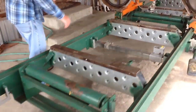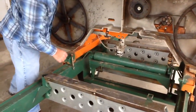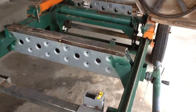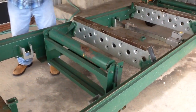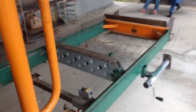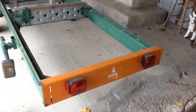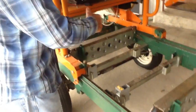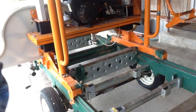I've done some changing on these guides — I took away the steel and put in aluminum over here and right here. When you hook up the winch, it drops in that slot right there, or here — any of the ends. It's a pipe pole with an electric winch on it, and I just use it to roll the log. I got it hooked up with lights so you can tow it. This trailer axle was too narrow, so I had to cut the axle and widen it out.